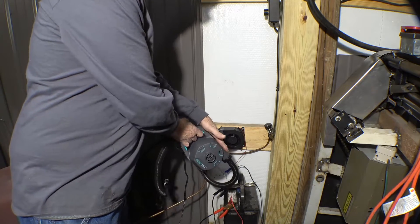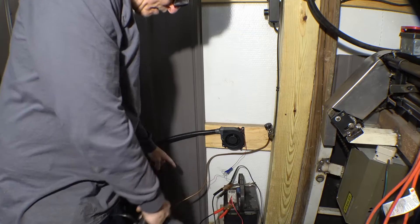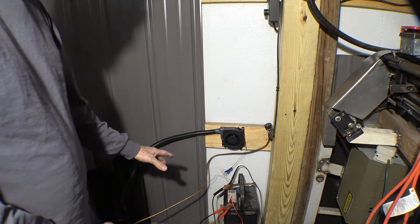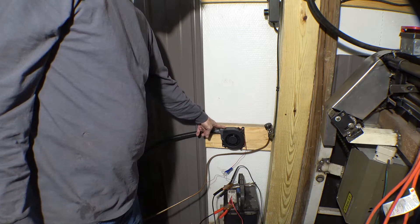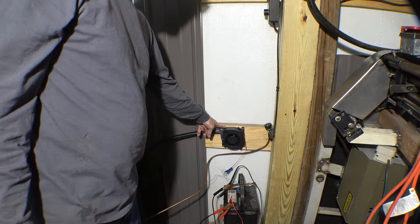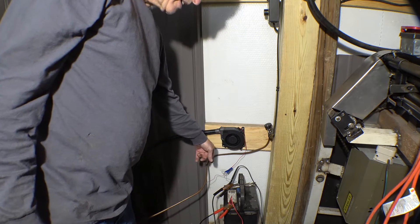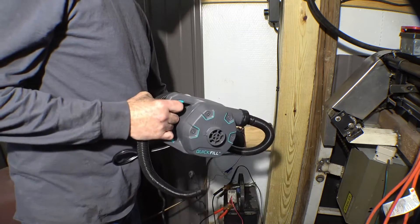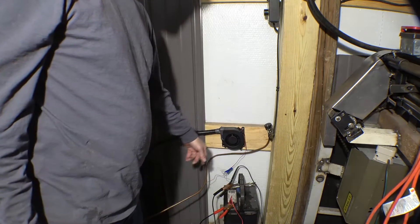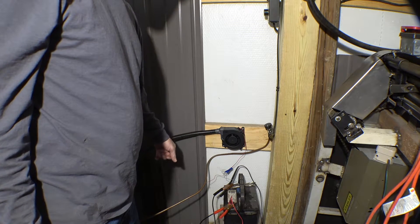This fan compared to this fan — this fan does put out a lot more air and pressure through the burner. So if you need a good blast of air you may not be able to use this fan. It does put out enough for my needs. I'm going to run it at about 14 volts. This fan has ball bearings, made to run forever, and it is half as loud as the other fan. You don't have to put it inside a box or anything like that. Works for my purposes — don't know for sure if it'll work for yours.